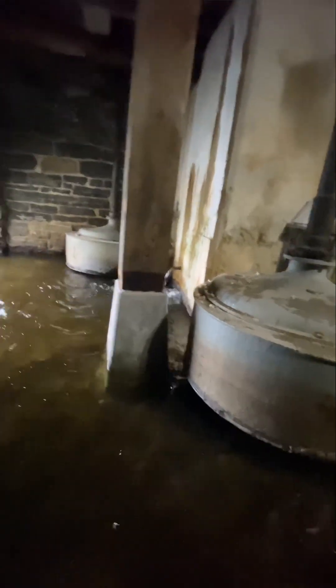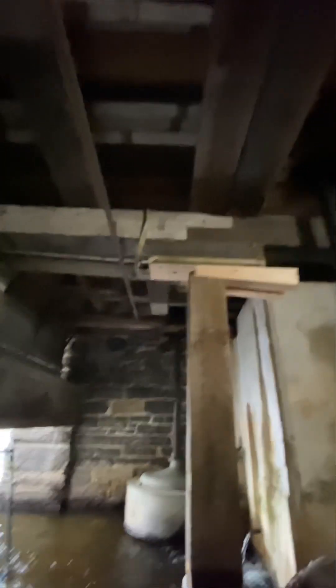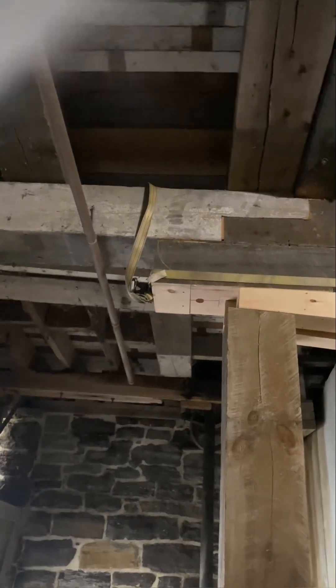Staging is out of the way. We're now going to start to jack under the bolster block. I put the off-cuts that we cut off on the ends, and put a strap back on so we can jack up against those without marring it. We're going to put a 20-ton jack on either side of this.